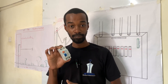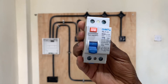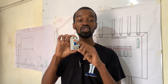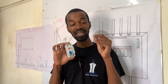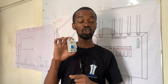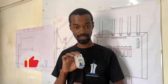An RCD — a residual current device — will detect a leakage of current from the live wire all the way to the earth or to the ground, and immediately trip, thus cutting off the supply of electricity in that installation, protecting the appliance from damage or saving a user who is receiving an electric shock.